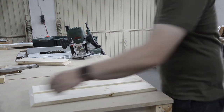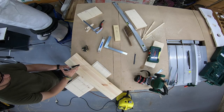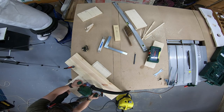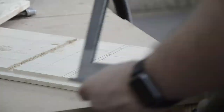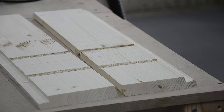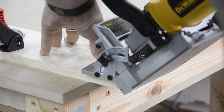The two inset bottoms should sit in a groove, which I milled directly afterwards. The miters should be reinforced with lamellos. To do this, I use a lamello milling machine to cut slots in the crosscut wood into which the dowels are inserted. You can connect the pieces of timber well with these flat dowels without having them slip.